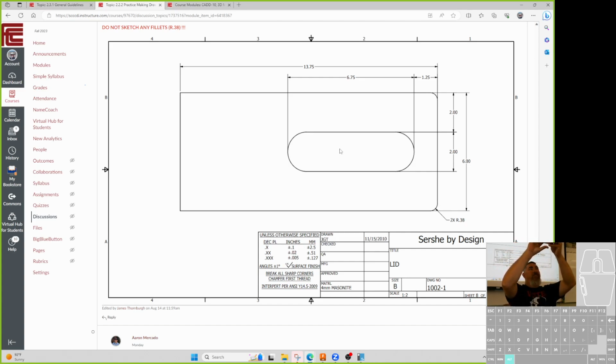If that went down to 1 inch, I can't get 2 fingers into 1 inch, or even just 2 fingers stuck together, which is 1 inch and 3/8. I need at least that much. So in this case, I need to have that size for my fingers. So that's the important dimension. So when we do it, this is what I'm going to care about. I'm going to make it centered and use this dimension, not this dimension, right?